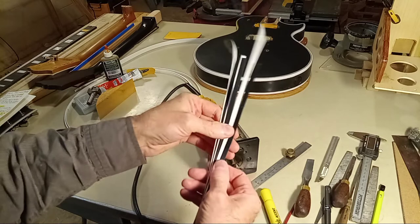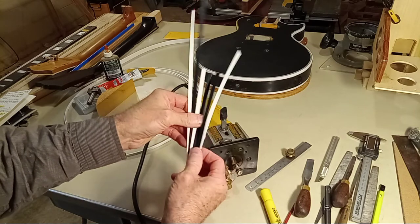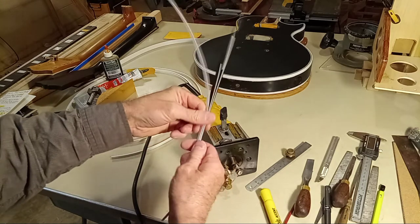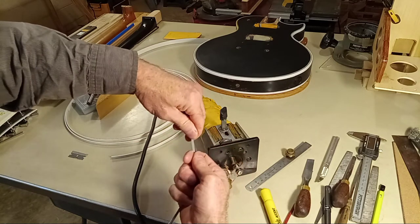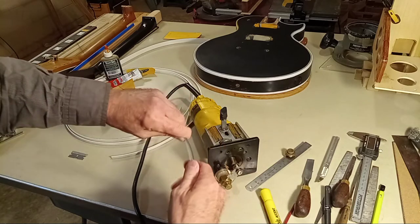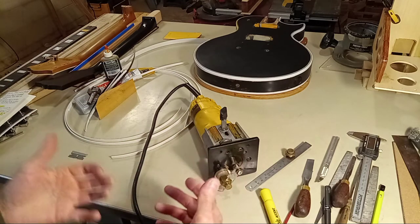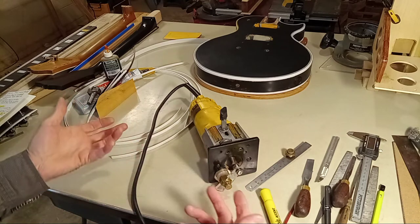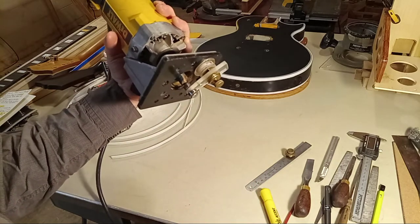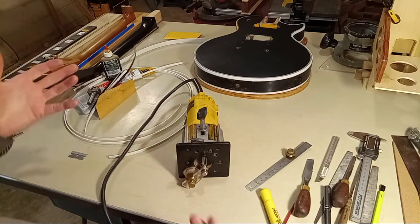With this little tool you can split the world — split it to hairs — and you don't even have to measure it. You just set the depth, grab your binding, and say, 'I can care less how thick that is, I just want to make sure it works.' These are 20 thousandths — 20, 40, 60, 80, 100, 120 thousandths right there. And then on top of that you put the Duco cement in, the binding cement. They're going to swell just a little bit.